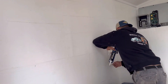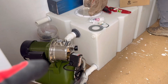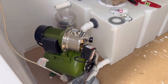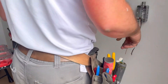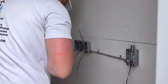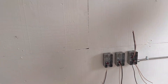You can see we painted two coats of paint for the customer. This is the 125-gallon tank — it'll have overflow. Then it's got the first flush, and from there it goes into the pump, out of the pump into a whole-house filter, and then out to a hose bib so it can be used for water usage. Right here we've got extra outlets on circuits for the pump and the air conditioning, as well as a regular 20-amp service circuit by itself so when some of this is not being utilized, they can use those circuits too. We just want to give them some extra outlets.